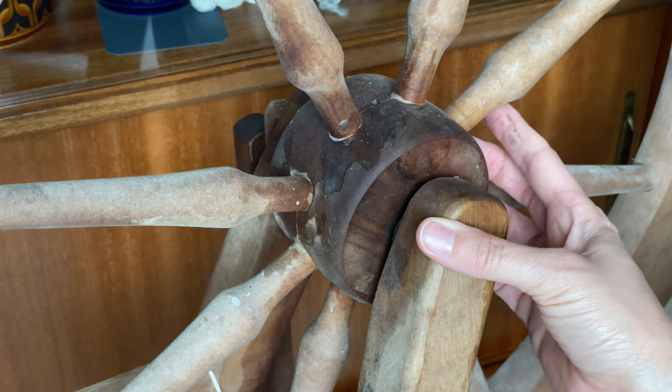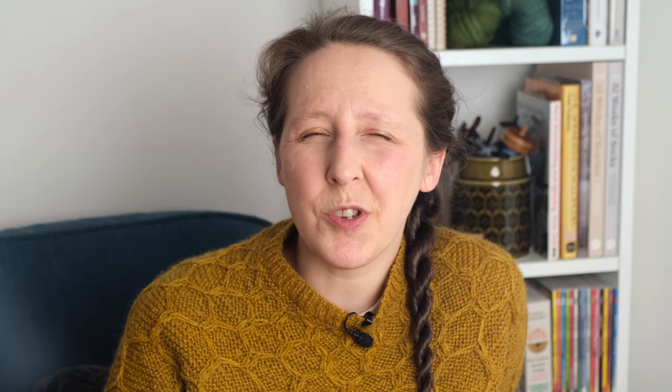The original plan was to completely strip down the wheel and rebuild, which would have meant taking out the hub pin, which is in this hole. Usually you can just gently tap that hub pin out, and I tried a couple of very gentle exploratory taps with a mini screwdriver and a rubber mallet, but I noticed that the slight split in the hub seam on the other side was getting fractionally bigger, so I stopped.